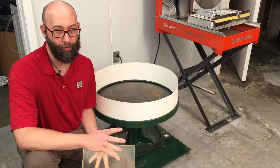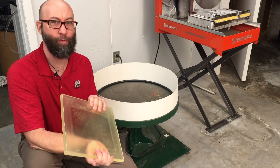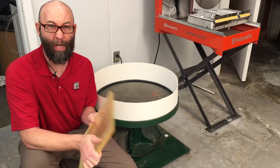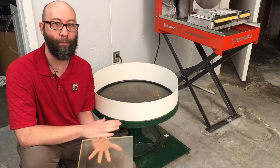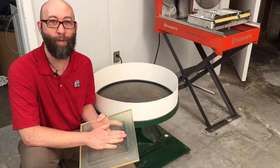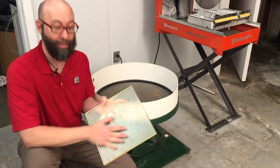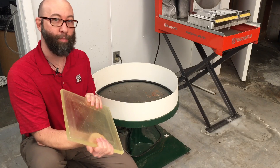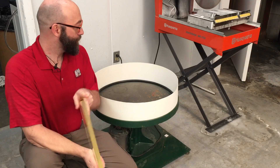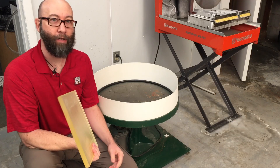Now that we've seen how a Reciprolap goes together, we're going to take a piece that we have cast here. This is a piece of lead crystal — the F2 material that we carry — that we've cast in an oven. It's got a fair amount of weight to it, probably about five and a half pounds, so it should be enough weight distributed in the Reciprolap to grind down our kiln shelf texture and give a nice polished bottom. We're doing this in a Reciprolap because it's very difficult to do a large flat heavy piece like this on a flat lap. We're going to put this in the Reciprolap with some grit and it'll show you how well it works to grind down surfaces like this.